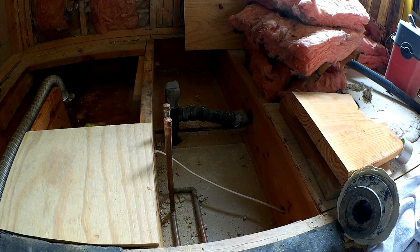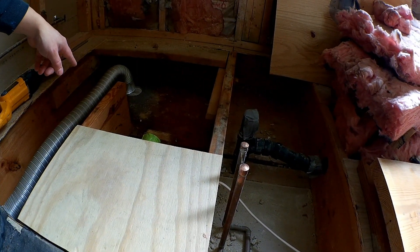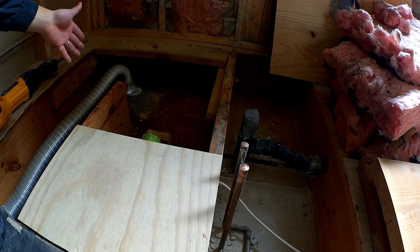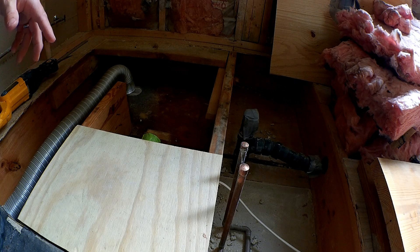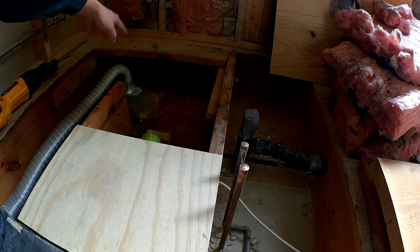Since these are two-by-tens, I can only take out an inch and a half from the top or the bottom to notch, and I can only notch the outer thirds of the joist. That's fine because I am on the outer third — this is the end of the house here, so I should be okay. That's to maintain structural rigidity of the joist, but the joist is gone now so it's not really creating any structure. It's over top of this outer wall because this is a cantilever — just an overhang on the back.